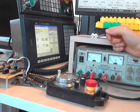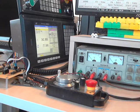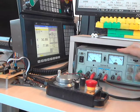For example, you can imagine some device sustaining a patient's life going off because a nurse turns on a microwave oven to make breakfast or something like that. So it shouldn't happen. And why did it happen? Because these power supplies, and this monitor too, are probably badly designed. There is an electromagnetic compatibility test to check every electrical device: does it produce electromagnetic interference, or is it resistant to electromagnetic interference?